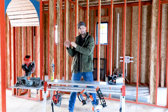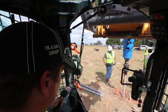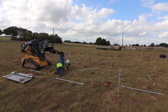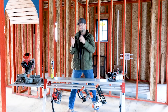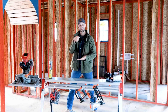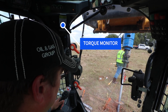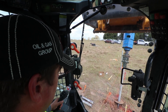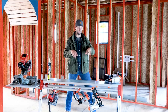If you saw my previous videos on the helical pile, you know that we have screwed in about 28 piles across the foundation of this house. We've got a floor plan of about 2,000 square feet on the first floor and about another 1,000 square feet upstairs. All of this is supported by 24 piles for the main house, and then my porches are also supported by piles. What I like about those helical piles is we know exactly how much force each pile is able to take, because we're monitoring our torque as we put those helical piles in. If we get 5,400 pounds of torque, we know that each one gets 70,000 pounds. Go check out this card here if you want to know more about the pile foundation.